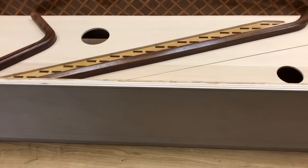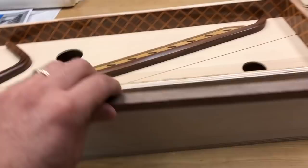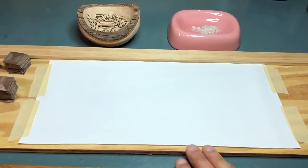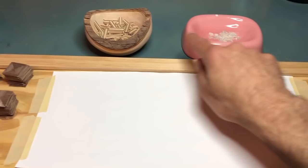I'm going to start assembling the veneer. The substrate I'm using is high-quality Baltic birch plywood. I've already veneered and finished the inside part, which is much easier to do in the inside corners before you assemble the case. The case has a molding strip on the top, one on the bottom, and a corner molding too. Using those as a guide, I've marked out the area for the field that's going to be veneered. To assemble the veneer, I've got a board of plywood with a generous piece of contact paper ready to go, and I taped on a straight edge as a reference guide. I have all the parts: the squares, the inlay strips, the mother of pearl dots, and a 45-degree triangle which is going to be very helpful.